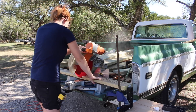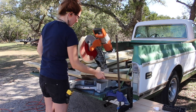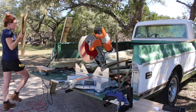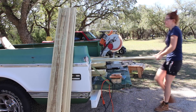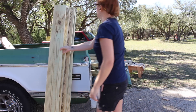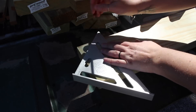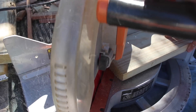For the picnic table I set up a stop block at the miter saw and started cutting all of the boards that will make up the top to length. If you want specifics, I do have a set of plans on my website for you to build your own. I'm going to be building the entire table from treated material, so once the wood fully dries I'll come back and give it a coat of paint. After getting all of the top pieces cut, I decided to cut the outside boards with an angle just to give it a little bit of a decorative look.